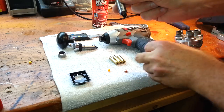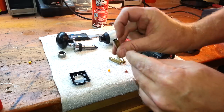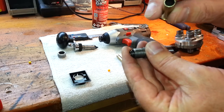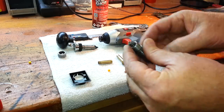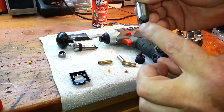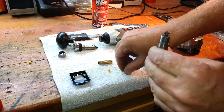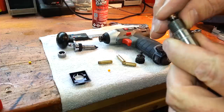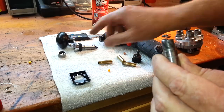What I found with the 300 blackout — and if you saw my other video — was that I wasn't happy with the amount of cut on the inner and outer chamfer. The cut length was okay, because that's done by this part here. But as far as chamfering and getting a nice clean chamfer, it just didn't work. The directions tell you to remove this ball, so take that collar out and the ball and put it back together. What happens is these inner springs that control the inner cutting blade don't have enough tension, and the outer springs have maybe too much tension.